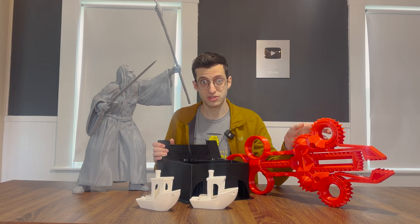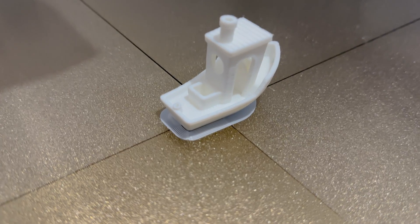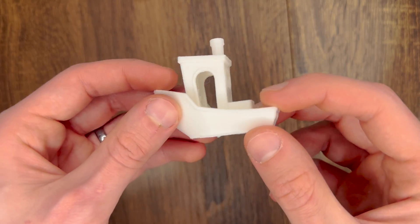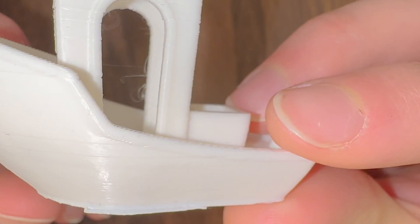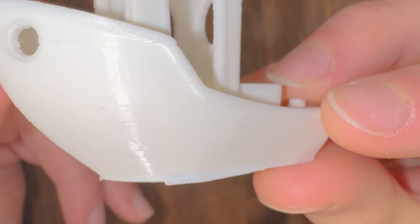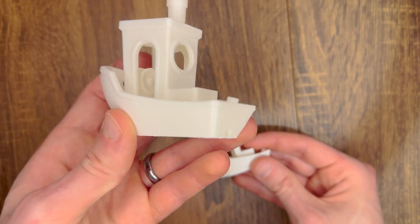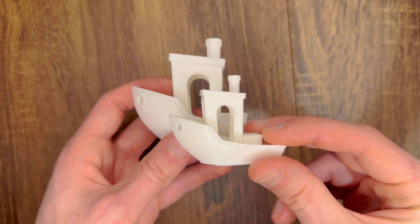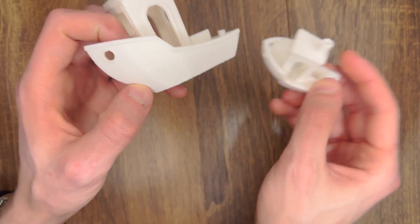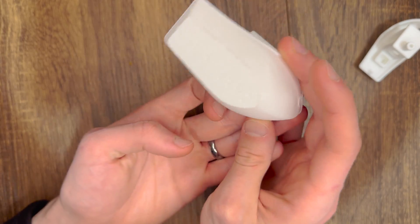Let's talk about some 3D prints, starting with Benchies. This first Benchie was made using a 0.6 millimeter nozzle and a brim bed adhesion — that's why you see the sharp unfinished edge to the first layer. If you look carefully, you'll see a whole bunch of horizontal artifacts. I believe I need to dial in my extrusion settings a little more. But overall I'm quite happy with this given how big the Elegoo Orange Storm Giga is. This second Benchie came on the USB of the printer and is a little bigger than the default. It came out a lot cleaner with fewer horizontal artifacts, and I'm impressed with the overhangs.